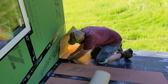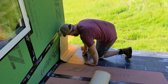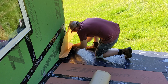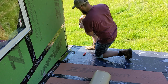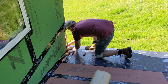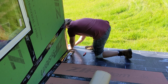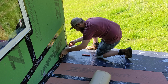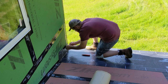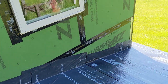I'm going to cut that where I can see it's going to be the end of the wall right here. Work the bottom part first — pull that over and I managed to give myself just a hair of extra. I might not bother to re-tape that. Get that up the wall, avoiding any fish mouths on the top or the side if I can. I'll probably come back and roll this — shingle style: this one over this one over this one as you go down. More or less what they say is that whatever your depth of snow — and our depth of snow is going to be minimal — any amount would have worked.